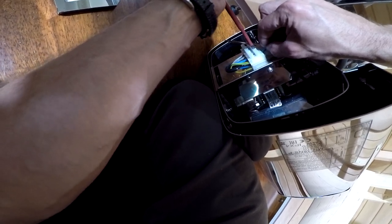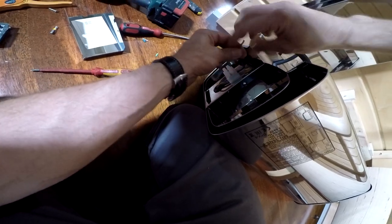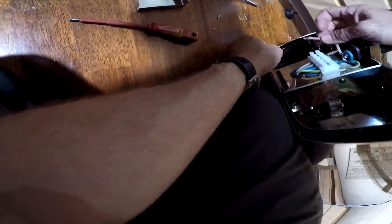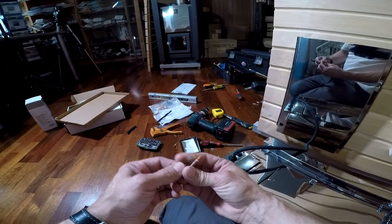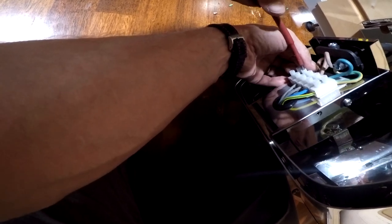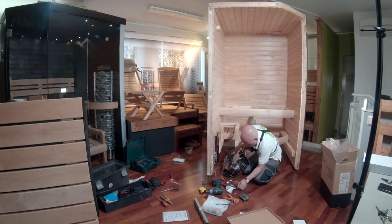And you could attach, like they show that 400 volt two-phase connection in here. But they don't have a jumper already supplied with this. So we need to have this one cable connected to two of those. And how are we gonna do that? Well, making a jumper piece. So what I'm gonna do is between these two and in the same hole, our jumper. And tight, yeah. This side as well, of course, there should be. Everything is tight. Good. Now we put the cover back on.